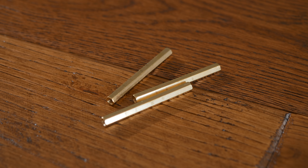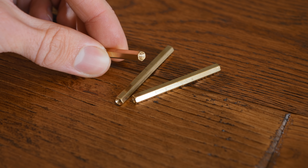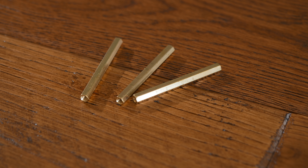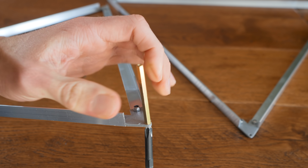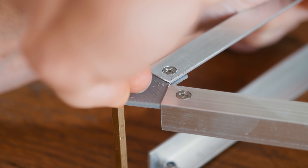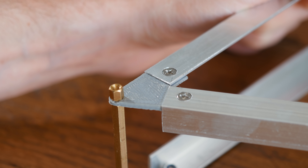Once you've done likewise with the remaining 3 bars, it's time to connect the two together. For this we're going to use 50mm long hexagonal screw mount spacers. I suggest ordering these from eBay, as it's the cheapest place I could find for them — again, there are links in the description if needed. One side can be screwed in place with the normal screws, but to attach the other side in place, we're going to use some shorter hexagonal spacers instead, as this will help us to mount them onto the wall later, which you'll soon see.